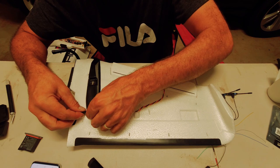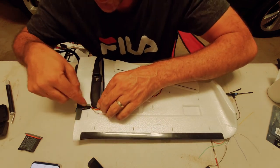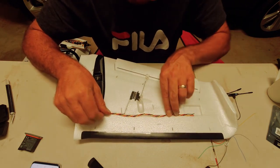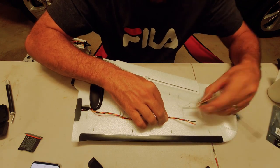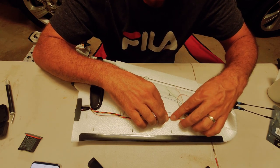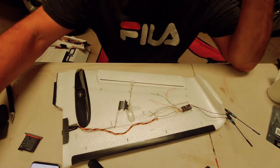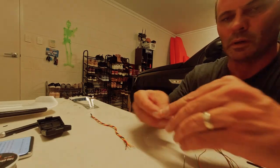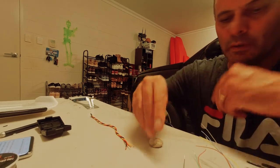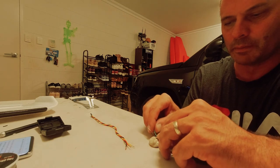Want to work out a length of the wire here, so I'll just plug it in, and it's a very tight fit for the two cables in here. That's the only thing. So run our wire along here, the slim going in there. I think I might cut it off about here, so we've got a bit of play here. I like to use a blob of blue tack when I solder, and find burying the wires into it helps to tin them up and solder them together.